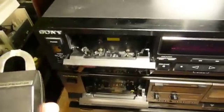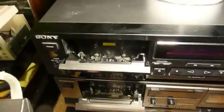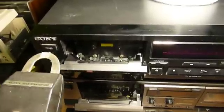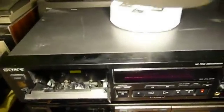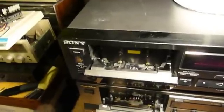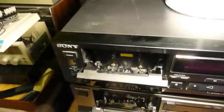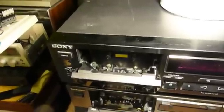When you're finished cleaning and you're satisfied that you've gotten everything cleaned up really well inside there, you're ready to do your demagnetizing if it's time to do that. With the demagnetizer, make sure you have plenty of room to roam — you may want to get an extension cord. Put it as far away as your arm can reach and then turn it on. Keep in mind that the duty cycle of these things is limited — leave them on too long and they may well burn up. Make sure you've gotten all your tapes and magnetic valuables out of the way, because this thing could wreck them.